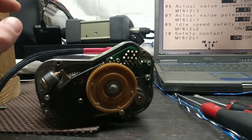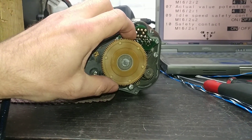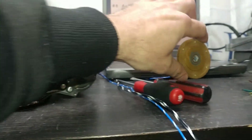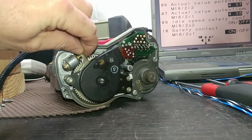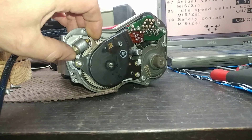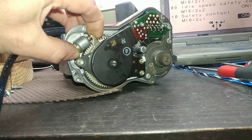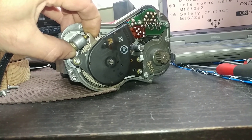For the second potentiometer, I'll pull the gear off — I already have it prepared. The gear is off. Now moving this by hand, the motor tries to keep it and spins to bring the throttle to where it must be. I can bring it to a location where it stops — somewhere around here — that's about right for where it's supposed to be.